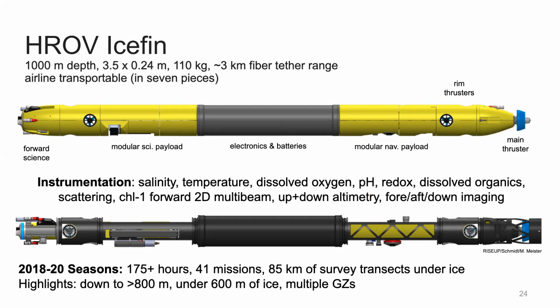And then right behind that, we have a Doppler velocity logger with integrated ADCP from LinkQuest. It's also been phenomenal. And then facing up is an altimeter. With the DVL and the altimeter, we have about 200 meters of range to track top and bottom. What's also cool about this module, unlike the other ones, is that it is basically neutrally buoyant down the center. So you can actually rotate it 180 degrees. If you want to track the bottom of the ice with a DVL and get HD imaging of that, you have that ability, and it's just as simple as loosening some brackets and turning the module.